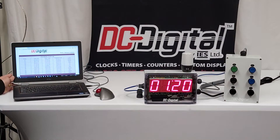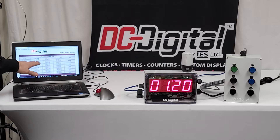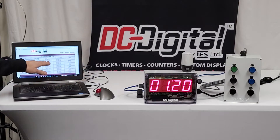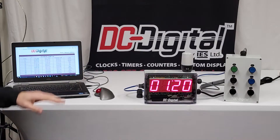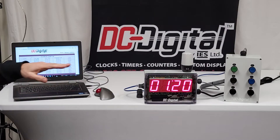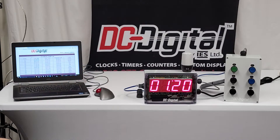I'm going to go to the display here on the laptop. It shows you 10 entries. When the timer started, it puts the time it was started and shows the time set. When you hit reset to the last value or reset to zero, it will log it. You can hit stop/start all day long and it won't record it until you reset it, because it's difficult to know whether that stop should count.